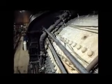And there's a bunch of valves in there controlled by these levers that go into the manifold inside the cab that you saw on one of the first videos. From there, opening those valves allows steam to flow down the several different pipes into the different appliances. This one goes down to the injector, which injects water into the boiler.